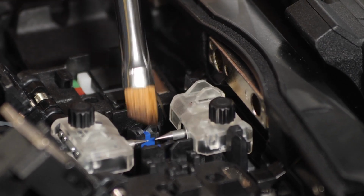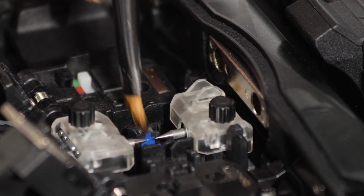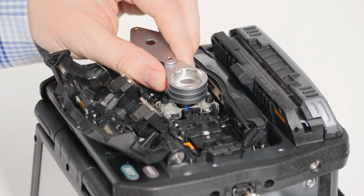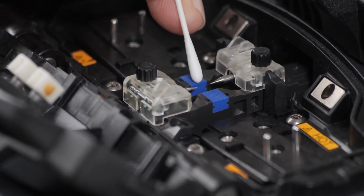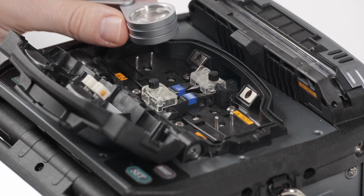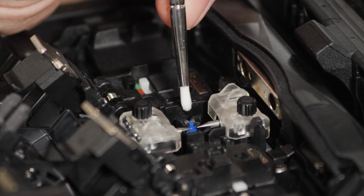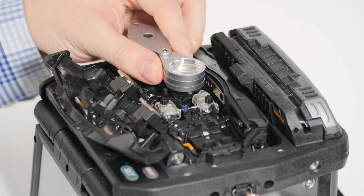Gently brush the V-grooves with the soft brush to remove freestanding debris. Next, inspect visually with suitable magnification to identify any contamination present. Now, use a lint-free cotton swab lightly moistened with the cleaning fluid provided to remove additional debris. Inspect again to assess progress. If still dirty, use the stiff bristled brush to remove more aggressive contaminants. Inspect again and repeat this scrubbing process until free of debris.